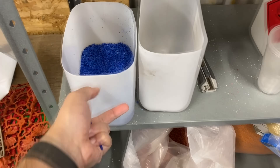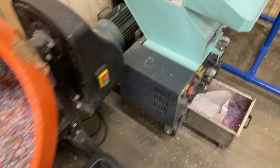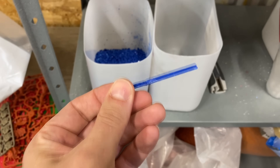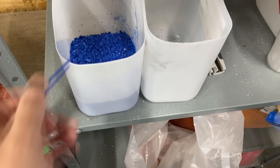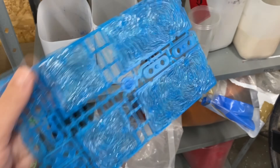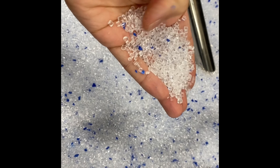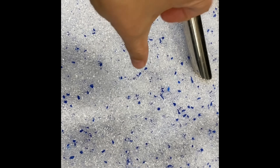Going back to the clear plastic — this is the dyeing agent. As you can see, it's just basically a sprue which was printed on our machine in here. We made a sprue with a normal 2% of dyeing agent, which became extremely, extremely blue — non-transparent material. And then we cut it into small pieces and it's mixed with material on the machine to get this. And here we have it. The clear plastic is obviously clear, and what we added in is just 2% of sprues which are cut into small pieces, and we get this.